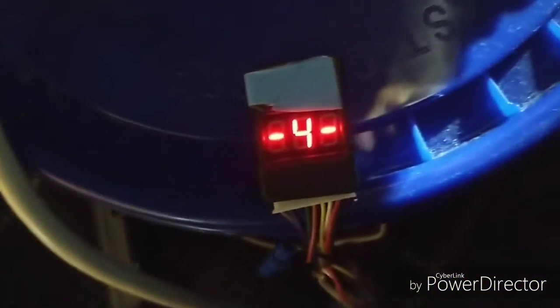All right. So one of my early morning updates, or late nights, whatever you want to call it. These are the current cell readings for the battery. I've been running it for 2 days now, trying to drain it down just how I normally use it. So at 14 volts right now: 3.48, 3.37, 3.63, 3.5 for 14.1 volts together. I have the TV running off of it at the moment.